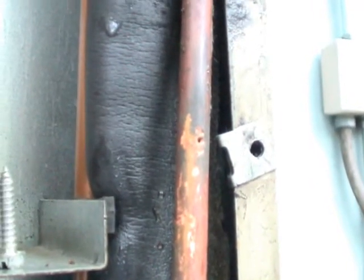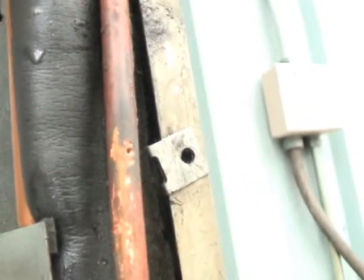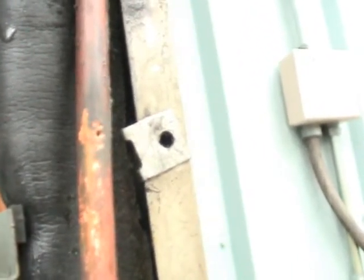So now I have to repair this hole. The first thing I'm going to do is take some emery cloth and clean the area around it. Shine it all up real nice and pretty. This way the solder will adhere to the copper easier.